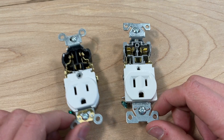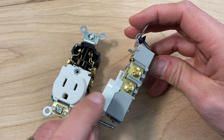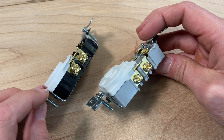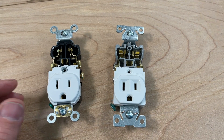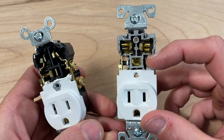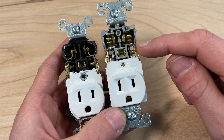Taking a look at the internals, we have Leviton on the left and Eaton on the right. The screw coming through the back yoke actually attaches — you have two screws that attach to the top housing on the Eaton. I really like that. There are failures where you see separation between the two housings, and just trying to take these apart as new receptacles, the Eaton was much harder, mostly because of the screw design but also just more robust overall. You can also see the internal plate of the back wire feature on the Eaton — I like that design.